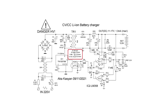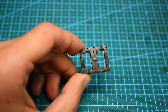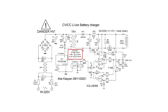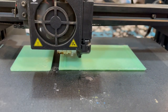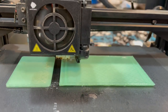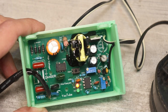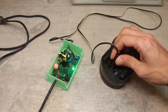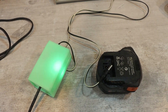The parameters of the transformer are indicated on the circuit. This is a flyback converter and a gap is needed between the halves of the transformer core — also known as a choke. The given parameters are relevant only for the specified core. After assembling and setting up the charger, a case for it was printed on a 3D printer. The indicator LEDs are perfectly visible through the case. The red light on means charging is in progress. When the red LED goes out and the green LED lights up, the charge is over. Everything is simple.